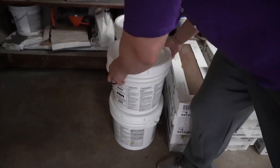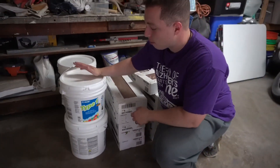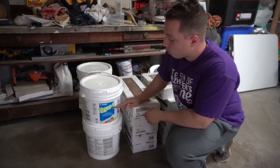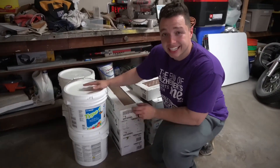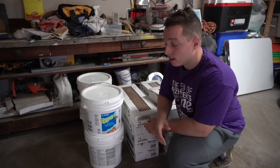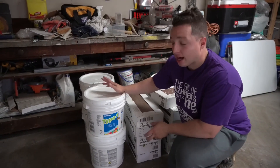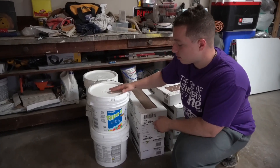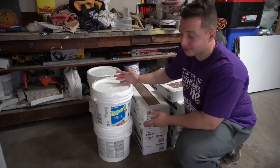The other thing I wanted to show you guys is what we're using to keep this tile down. For me, what I've used in the past and it's worked phenomenal is this Type 1 adhesive tile. It takes a little bit longer to settle — you kind of get that mush for maybe about 24 hours where you can't really walk on it. But if we can wait two days before we start grouting, I'll take that because this has been phenomenal. It's about 35 bucks, and that's what works for us.